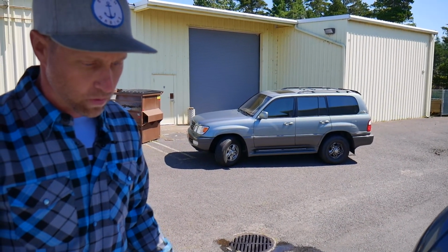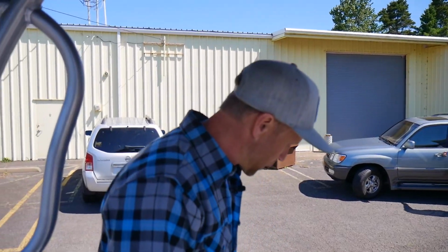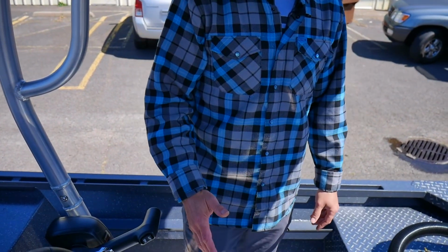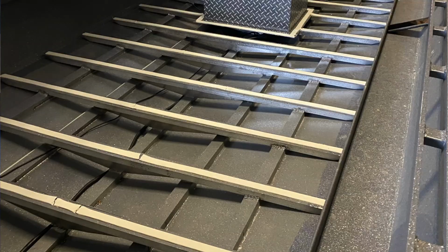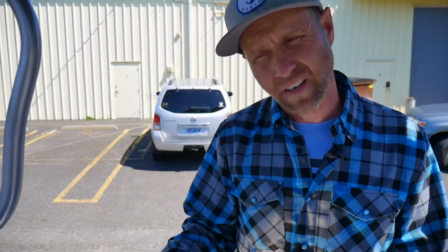It's a beautiful boat, heavy duty all around, overbuilt boat, 160 bottom, 125 sides, extra tray for stability and strength. I've got a picture, I'll put it up here, of the entire grid underneath the floor. A lot of people think, oh, well, the heavier the bottom, the better. To a point. It's how you support that heavy bottom.